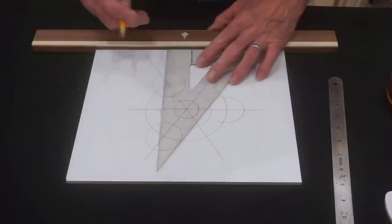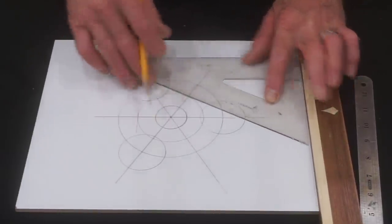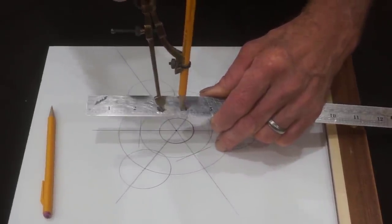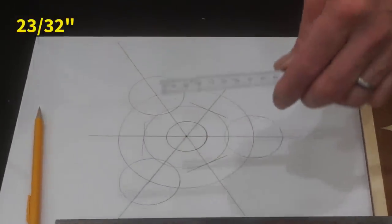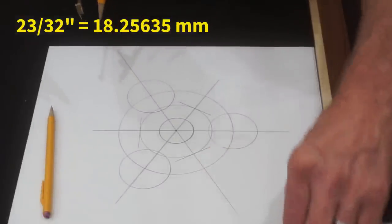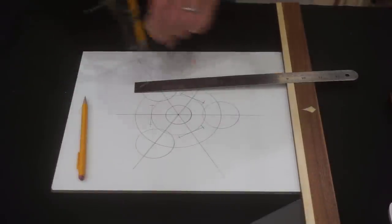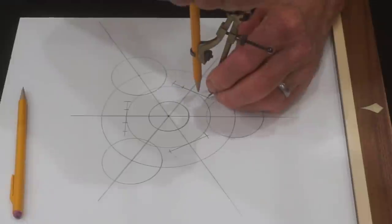On three center lines between three edge contour notches, use the drafting square again to draw perpendicular center lines for oval bottle centers at the intersection of the straight lines and that three inch diameter circle. Now it's time to add three-quarter inch diameter circles spaced to one and seven-sixteenths inches outside to outside for the total oval bottle width. Reset the compass again to 23/32nds of an inch — or for metric users, 18.25635 millimeters — and draw two arcs that cross the center lines we just drew.